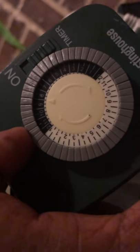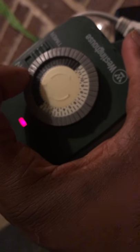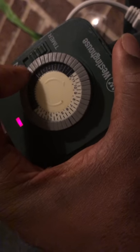Now you have to go ahead and depress the tabs — there we go — and push down. I want to start from seven because it gets pretty dark pretty fast over here, so push down all the way to probably 10:30 or 11. I believe all my neighbors' lights are already out by that time. So that's set to 10:30.